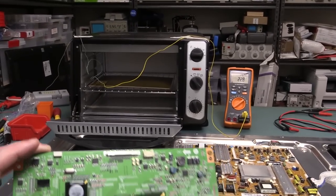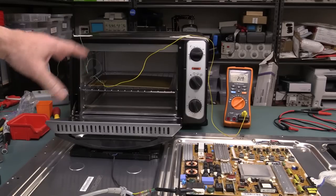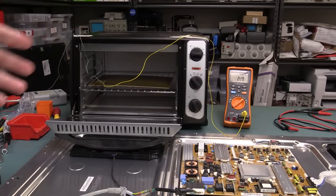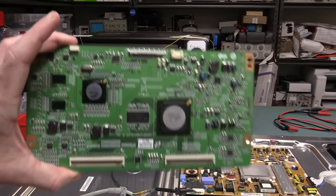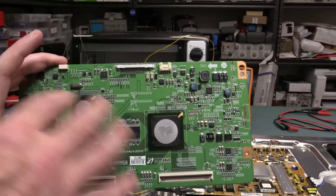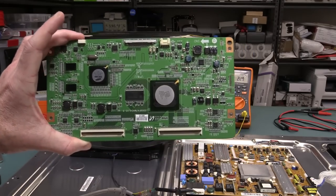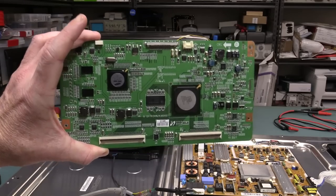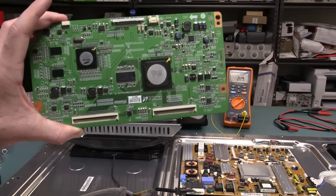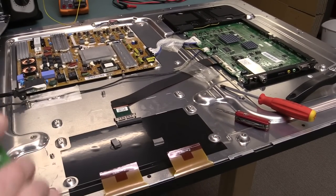The next step is to get medieval on its ass and whack it in the reflow oven. I'll put it through a standard temperature profile — I can't remember what profile I've got set up for this Beta Layout oven, as you've seen in a previous video. But it's a pretty stock standard temperature profile so it should work. I'll just whack that in there and it'll take about five minutes or so, hopefully — heat everything up, reflow all the joints, and if there's any problem in the joints it would fix it. Fingers crossed, but I don't know — I don't think the chances are too high.